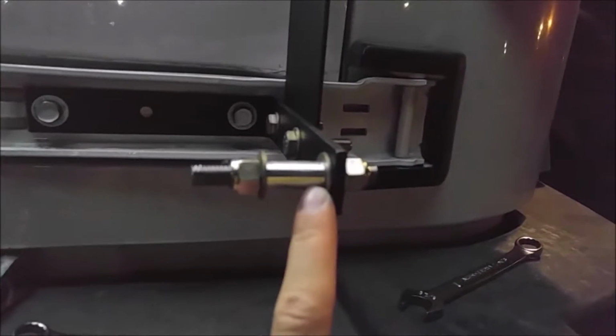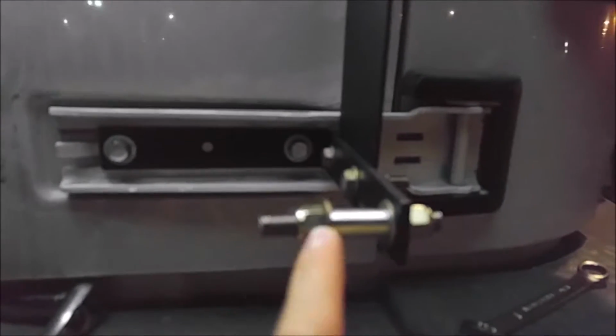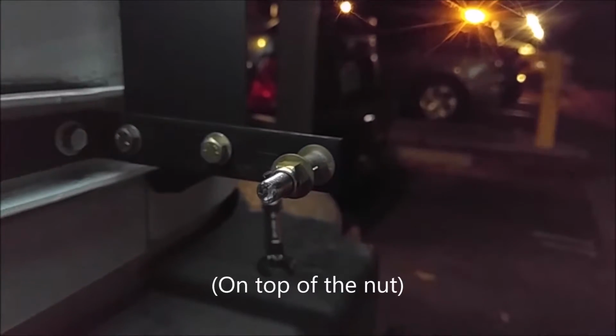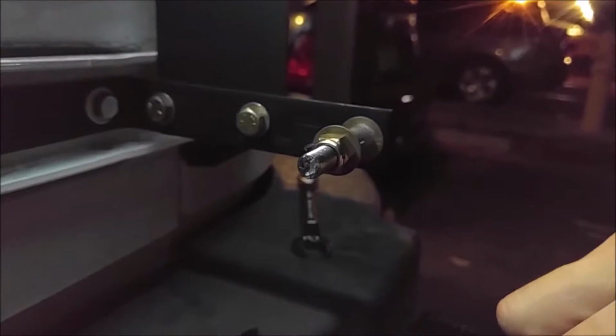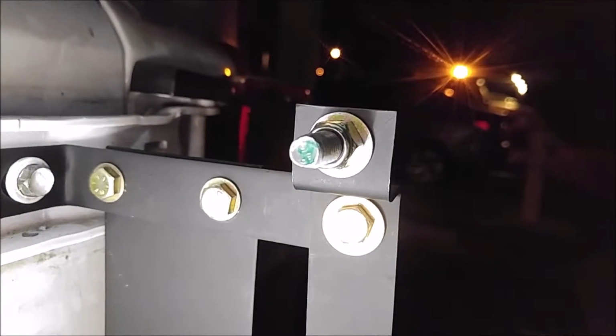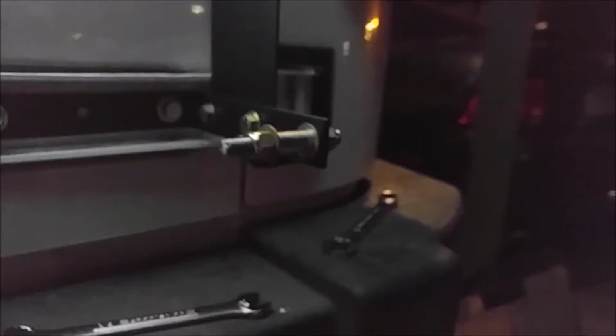And there's a washer on each side of it just to help share the load, because again, same thing here. The jack is actually going to rest on top of this bolt. And so you can see I've turned this bolt flat. So you've got a flat head here for the jack to actually rest on. And same thing up here. The bolts are turned flat. So the jack's going to rest on that. I'm going to take another washer, another lock nut, same thing, and tighten it up. So it's going to squeeze the jack here.